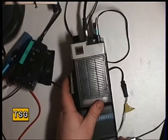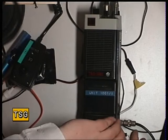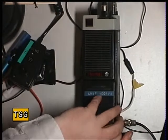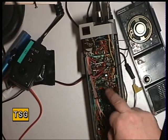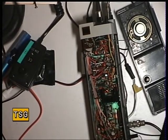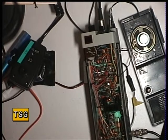I've already taken this apart and it's coming in for service. It was last in for service 16 years ago, so I have seen this one before. This is an early one, and on the early one there isn't an RF adjustment potentiometer, so it's all done with the coils. You have to detune it if it's over 3.5 watts — they're not 4 watts, they are 3.5 watts.